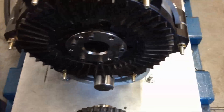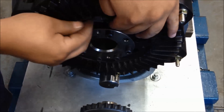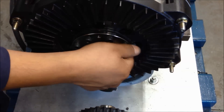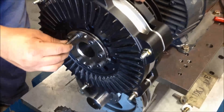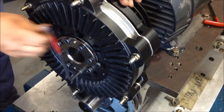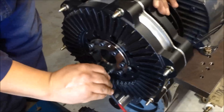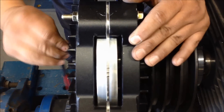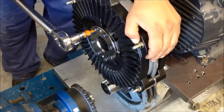Rotate the coupling until the bolts are at the twelve o'clock position. Install the shaft shims between the flange and the induction rotor face. Install each socket head cap screw on either side of the bolts to keep the shims from falling out. Repeat this step for the second set of shims. Using an Allen wrench, tighten the eight socket head cap screws on the face of the coupling shaft. Verify that the air gap is equal after all of the bolts have been fully tightened. Using a torque wrench, tighten the bolts to the specified torque outlined in the FSC instruction manual.